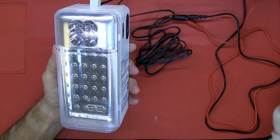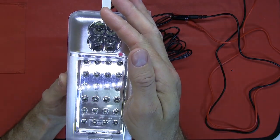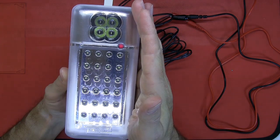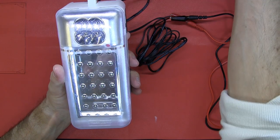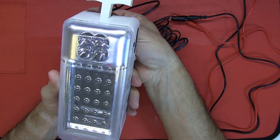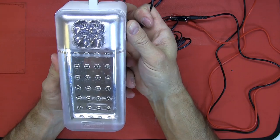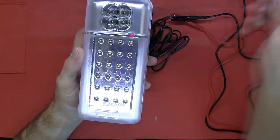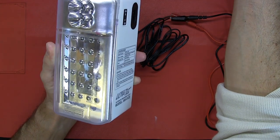Switching the power supply on now — it's showing 40 milliamps and it looks like the LED is on. I can hear a relay clicking inside. There's no current limiting happening on my power supply, so it's not drawing a lot — certainly not enough to indicate it'd be charging. Nothing's happening there, so I'm going to assume it's not charging. Let's continue and take it apart.